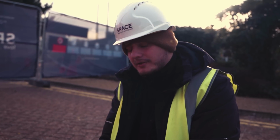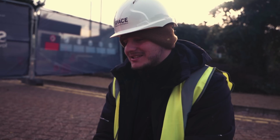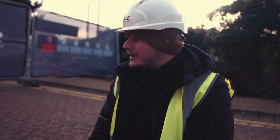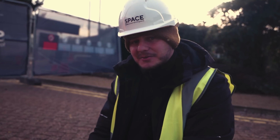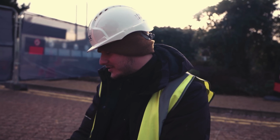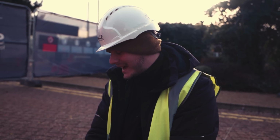Now you've seen from that lovely B-roll sequence we've done, this is all full of water, damp. So that means someone's disconnected the earth because it was tripping, to keep this rolling. But this is an outside bit of kit. This is external to the building. It's got no connection to earth. Under fault conditions, the potential of this would rise. Yeah, that is incredibly dangerous and a mad find.